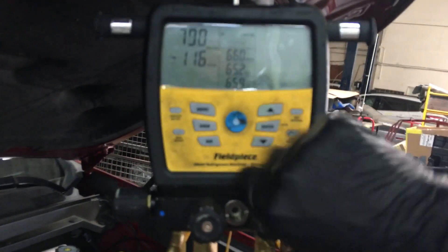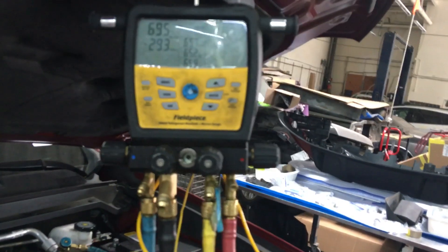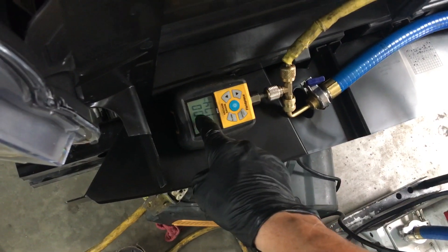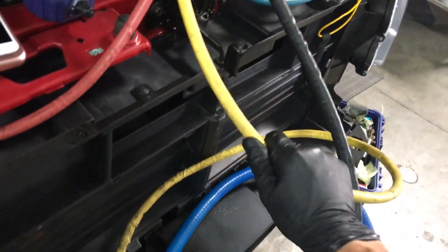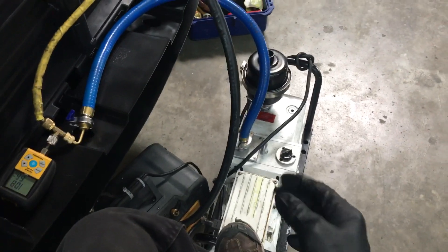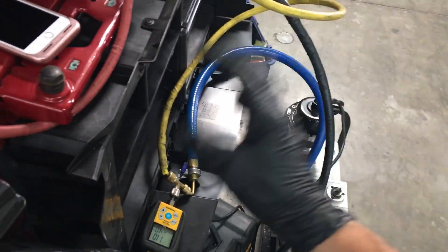Let's open up this vacuum pump to it. I'm opening it up — I just added a second vacuum pump. I heard a second vacuum pump makes no difference because somebody's seen it on a video. We just went from 56 microns up to near 100 microns right there because we just opened this line to the rest of this system. And this is coming down faster now because in a laboratory when everything is perfect, they say two vacuum pumps doesn't make a difference. Well, it makes a difference, especially because you're now down to the molecular flow — you're not flowing volume, you're trying to pull mass. This is rated down to 3 microns. It does more than just a regular vacuum pump.